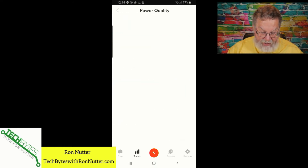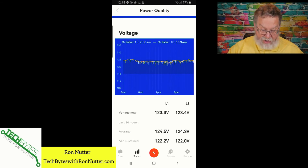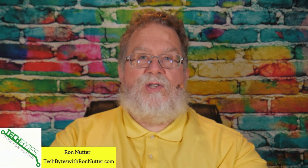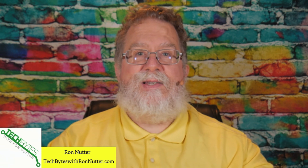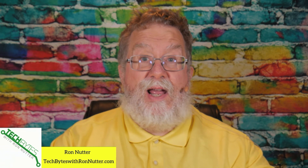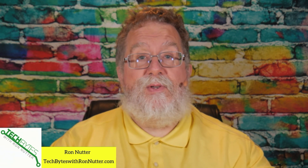Power quality — it should come up here in just a second. It's doing better. Now that we're moving into fall and air conditioners are running less, power seems to be staying a little calmer. The voltage: L1 has been running a little to the low side and L2 went high, so there's probably always going to be a little juggling on that. It's nice to have this data because if strangeness comes up, I've got on-site equipment recordings to stand my ground with the power company — and if they want to dispute it, they can bring out their own chart recorder.